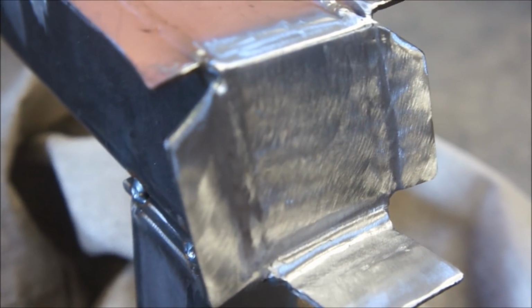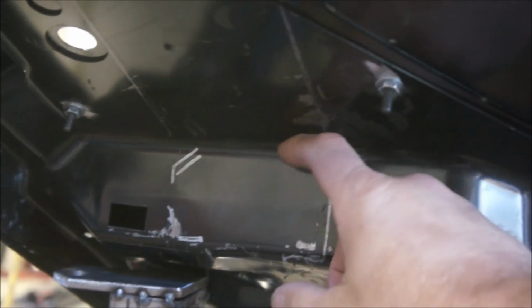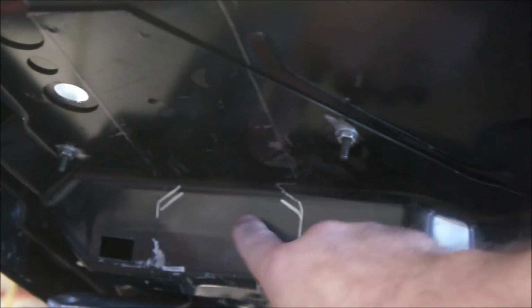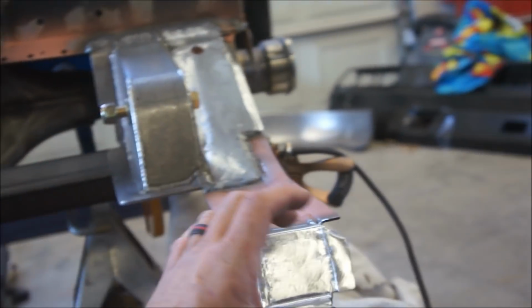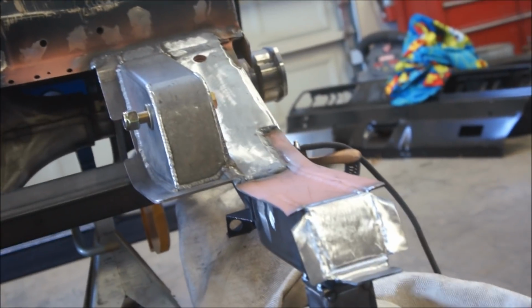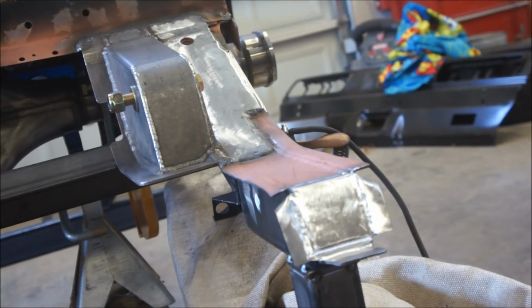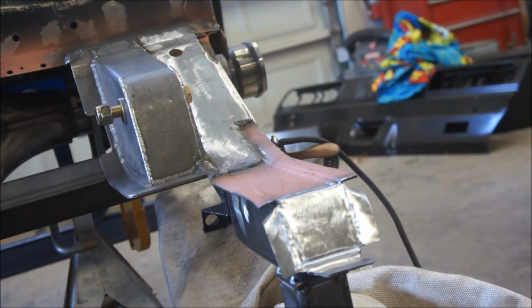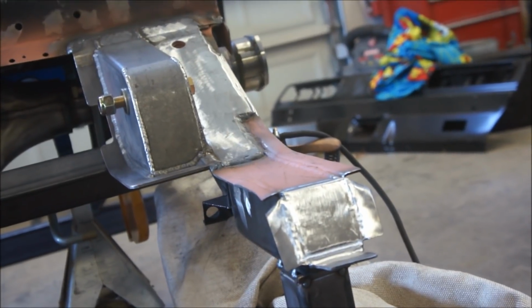Pretty seamless, but so yeah, this pocket here, which is your torque box, will basically fit up against there, and the ears will plug weld. And I think I'm going to cut that away, if I remember right what the plan was, and actually weld into this frame and box, and weld my subframe connectors in there to where it's all one piece. So that'll actually get more welding. Either that or no, I think that's what I was going to do. I don't know. I'll kick it around.